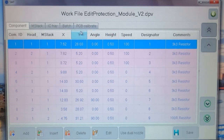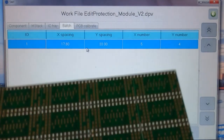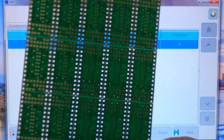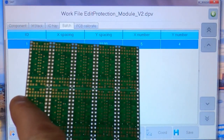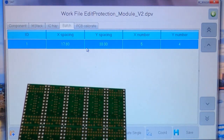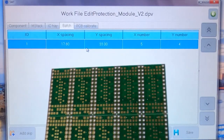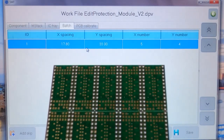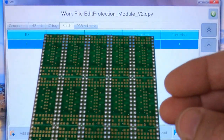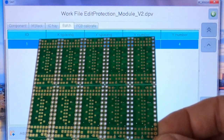All we need to do is tell the machine what we want in the batch. Before you do this, you've got to decide which way around you're going to mount the board. In this particular instance, I mounted the board this way up. The X direction runs left to right and the Y runs front to back. You then need to determine what the spacings are for the board, which will vary depending on the type of board and whether it's been milled or V-scored. It makes no difference to the pick-and-place machine — you just need to tell it how far to step from one board to the next.